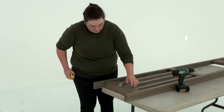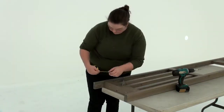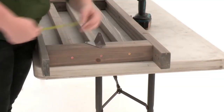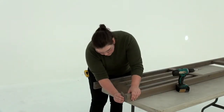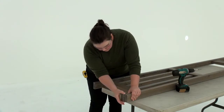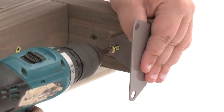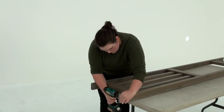Perform all of step three on a flat, raised surface. Measure the two posts at the bottom of a post panel to identify the wider one, which is the panel post. Position a room L-mount on the inside of the panel post and make sure it's flush to the bottom. Attach it with a pan screw. Repeat to attach a room L-mount to each post panel assembly.